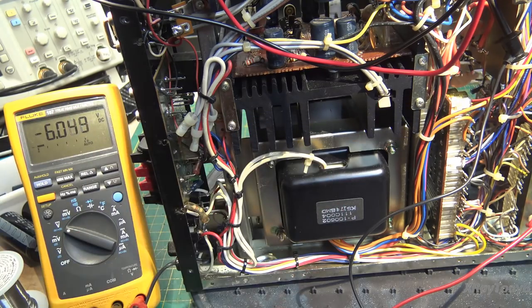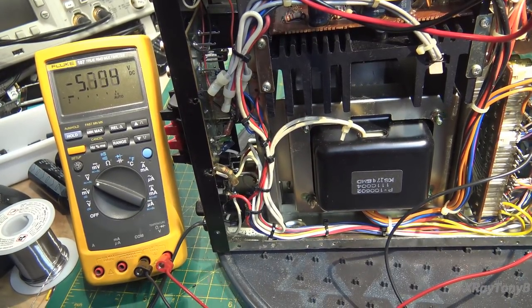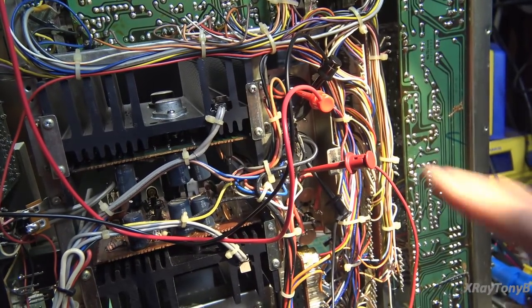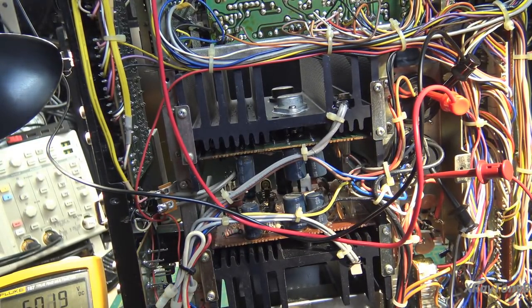We have that board all recapped. I replaced that twisted, cracked old power cord with a new one, tidied everything up and re-zip-tied it nice and neat. I have my two voltmeters across the main filter caps. I checked everything out statically and it does look like this thing was not touched or modified. I'm always a little more cautious whenever I get one of those as-is receivers — when these things come in, you don't know where it came from or if other people tried to work on it first.